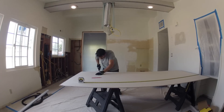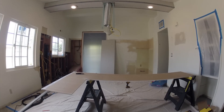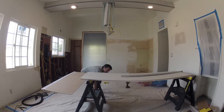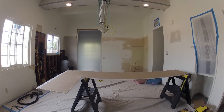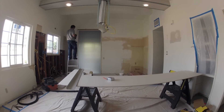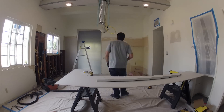Neil had a sign that said 'don't forget the water line' — that was a good note. Here I'm just working on some drywalling. Neil is working on tiling the bathroom at the other end of the house while I work on projects in the kitchen. We realized we didn't have any insulation in any of these walls, so I wanted to install some new insulation from Home Depot. Here I'm just cutting sheetrock, making adjustments, fine-tuning it, drilling in the sheetrock screws, and trying to fill in all these sections so I can start taping and mudding this area.